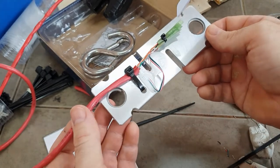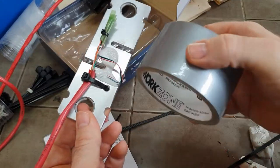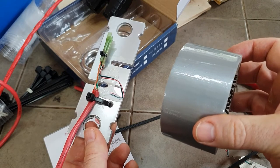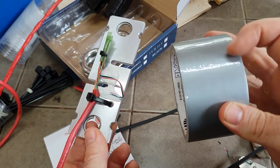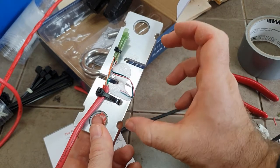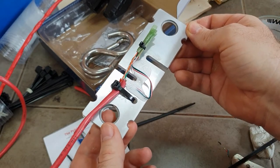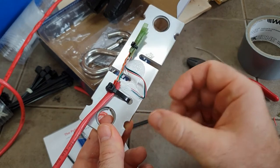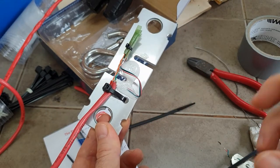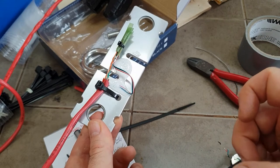What you could also use is some Universal Fix-It duct tape and just duct tape it all up. I typically wouldn't want to use this because anyone who's used duct tape and watched it degrade over the years will know that eventually the glue starts getting really sticky and comes off and just gets manky. So I will typically want to use a piece of heat shrink here. If you really need me to show you how to do the heat shrink bit I can, but it's fairly self-explanatory. You slip the sleeve over, use a heat gun - be very careful not to burn any of the insulation off the little wires. Just be ginger with the application of heat.